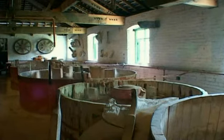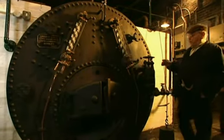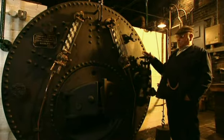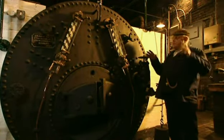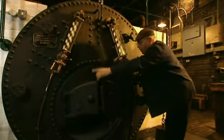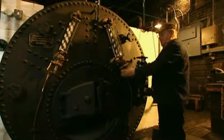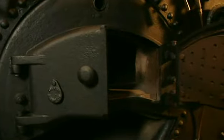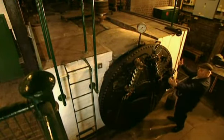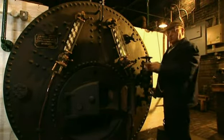To make it all work, they had to have an efficient way of raising steam. This is what's known as a Cornish boiler — reputedly invented by Richard Trevithick in Cornwall, that's why it's called the Cornish boiler. Basically it's quite a simple thing: it's an iron tube with two end plates. Then there's another iron tube of a smaller diameter, which is termed the fire tube, which goes from this end right through to the other end. At the front end of this tube, behind these doors, the fire is lighted on the grate. The products of combustion go around the end of the back of the boiler, up there and along the sides, and then finally go up the chimney. So they utilise as much of the heat as they can out of the products of combustion.